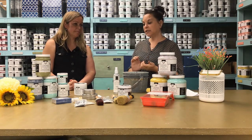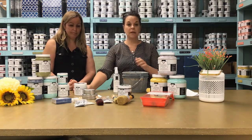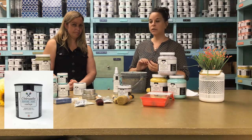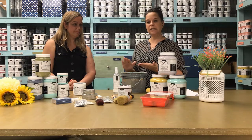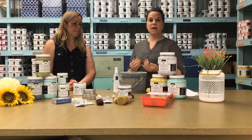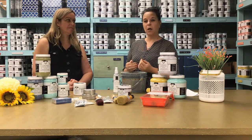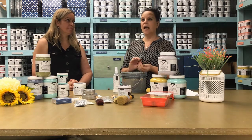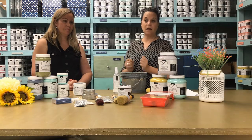It's also suggested, depending on the surface you're painting, to come in and use a primer — especially if something was painted with oil or if you're not quite sure what existed there before. It gives a good seal and a good base. When you spend all this time on preparation it might be a little longer, but in the long run it pays off because your paint is going to stay. You won't have chipping or peeling and your color will last a lot longer.